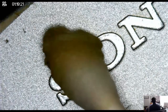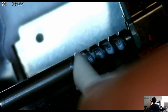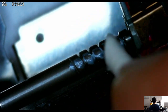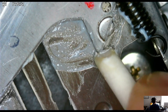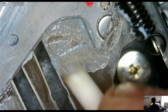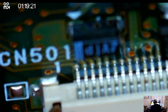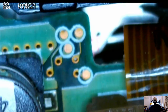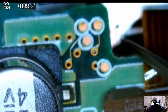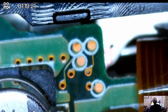This will be something I'll try and showcase or use as a daily driver. Here we are adding silicone grease to the screw that's going to be moving the playhead, and then moving the playhead across to spread the lubrication there. This is lubrication on that dried section, and I'm going to be putting the ribbon cables back now. I feel like I did enough cleaning over a couple sessions.